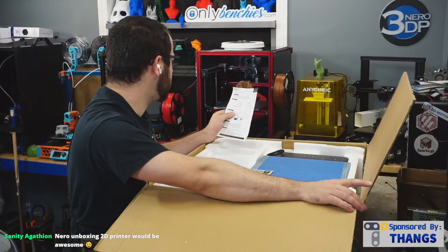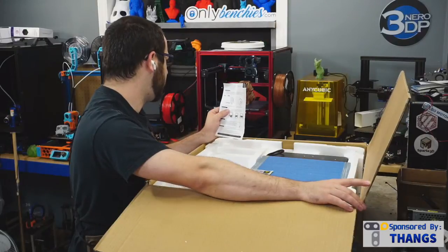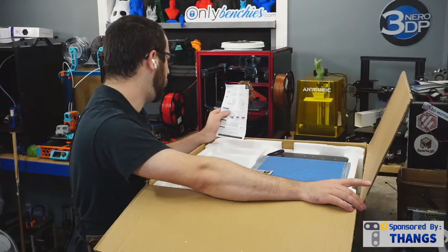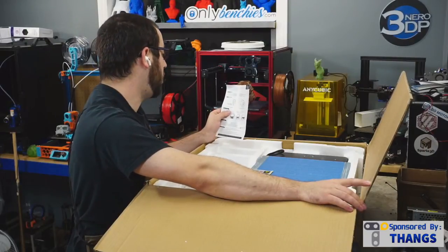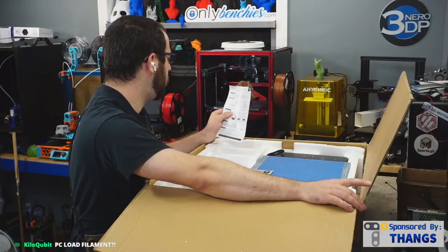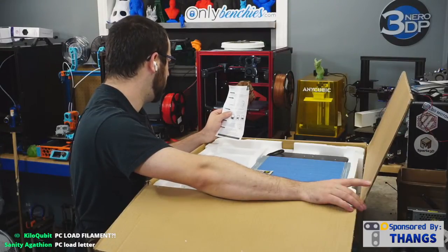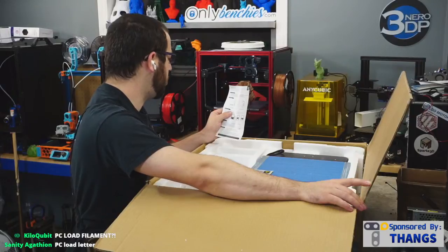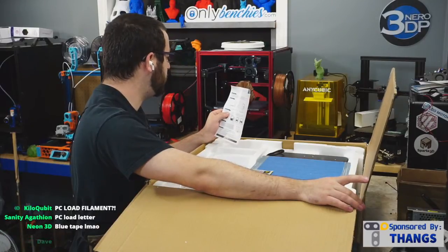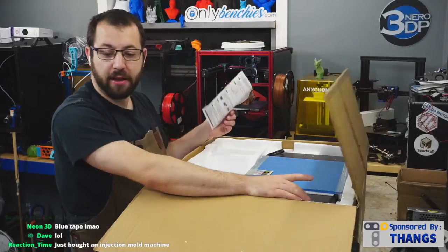So, in terms of my instructions, it is printer assembling: take out machine parts in the package, printer base, frame, filament holder, toolbox. Let printer base pass through frame. Beware, that's two separate words, beware of the screen, should be the same direction as the frame, as shown as pick. Aim the point A to B point. Fix between the slot, then use large screw and shim to install. That is my instructions to build this thing. On the other side of the frame, should install filament holder using small screw, then connect wires. That is it. That's my whole instructions.